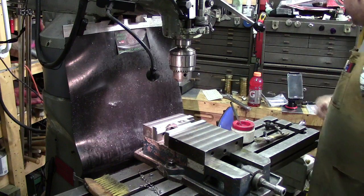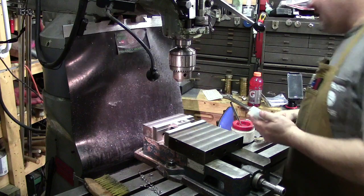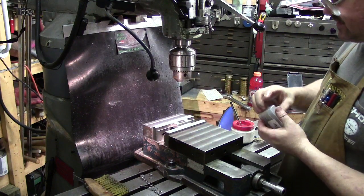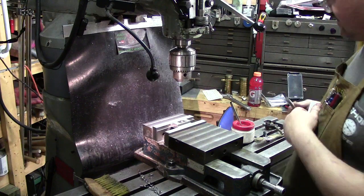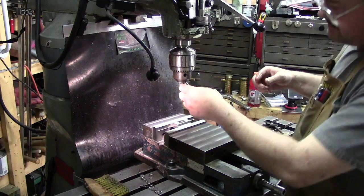Set this over here out of the way. And this set has a taper, a plug, and a bottoming tap. And we've got it up on parallels. We've got plenty of room. So we're just going to go with a plug, and that'll do what we need to do. And we'll get the...